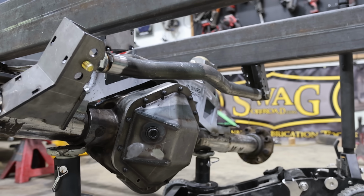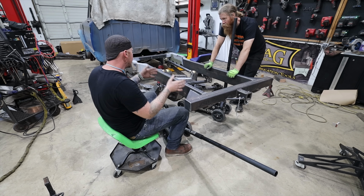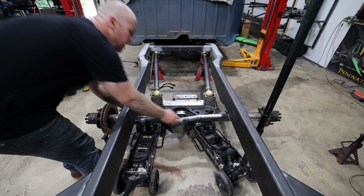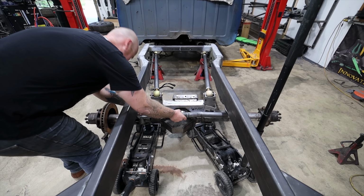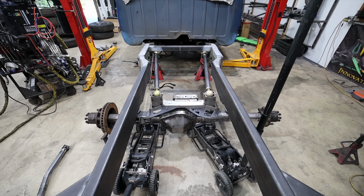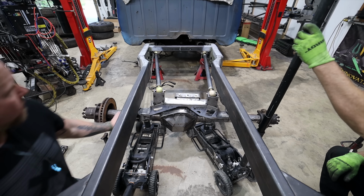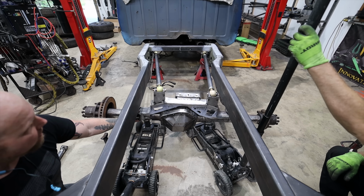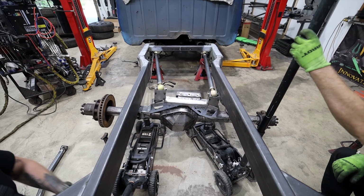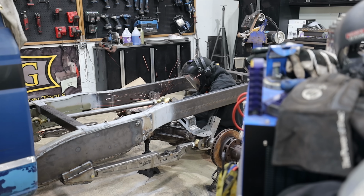Now, if we burn this all in, and it was all just 1/4 inch steel welded to 1/4 inch steel, this could be one of those characteristics where the ride is a little funky and we don't know why, or it burns through bushings faster than normal or whatever, and people will just live with it. But as you can see here, that binding is a huge problem from this tiny little bit of triangulation of the upper links. I even pull the panhard bar out of the way and we cycle it, and that problem doesn't exist anymore. It's no longer trying to float both sides whenever I jack up the one side.